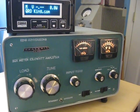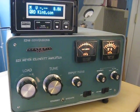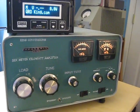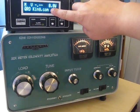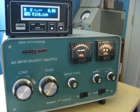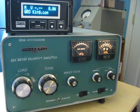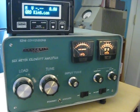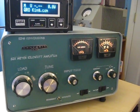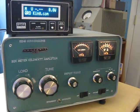Hello, this is Lee, WW2DX, and I'm going to do a quick demo of a modified SB220 amplifier that I had Lou from QROKing.com — you can see the address right there — modify for me. It originally covered 80 to 10 meters and Lou converted it to a mono-band 6 meter amp. It has a pair of 3-500s in the finals, and I'm going to show you what it can do here on 6 meters after Lou does his magic.